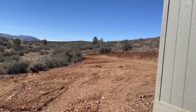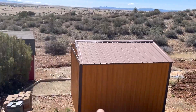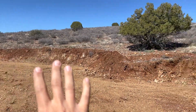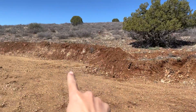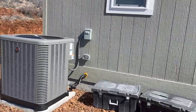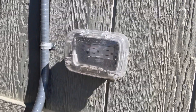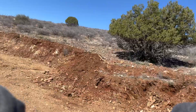You see these two sheds over here? I need to move them up closer to the house so I can connect them to power. Over here you can see I leveled out a pad for these two sheds to move up over to here. Eventually the plan is to do it proper — get permits, run a 100-amp subpanel from the house to the sheds so they can get their own dedicated power supply. But for now, once I get them moved, I'm going to be running them off of this one single 20-amp circuit, which isn't much better than the 15-amp circuit my workshop is currently using.